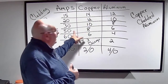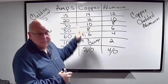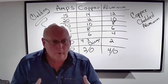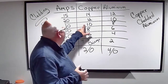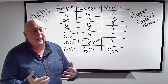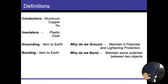And most of them aren't that expensive, so we're not going to get too much into it. But if I got a 14 gauge wire on a 40 or 50 amp breaker, now I'm really rolling the dice. That breaker is going to allow 50 amps to travel through something that's really only designed to carry 15 amps. And then I'm taking a big push on it. So every inspection that we do, we want to check and make sure that we do have the right size breakers for the right size wires. Now, the other way around really doesn't matter. So if I had a 10 gauge wire on a 15 amp breaker, I don't care. I'm just limiting the flow that's going to go through there, but it's not like I'm creating any sort of hazards. I'm not making the wire the weak link, and that's what we want to avoid. We don't want the wire to end up being the weak link. All right.